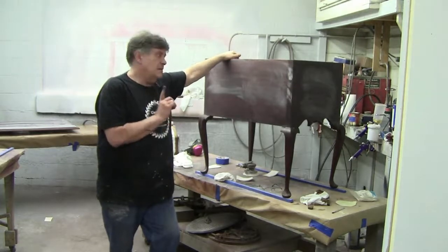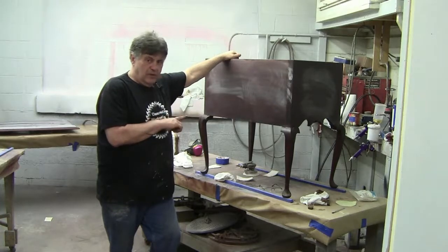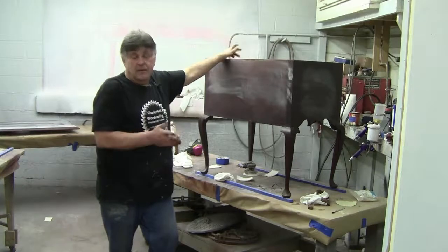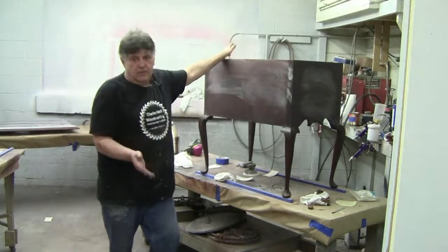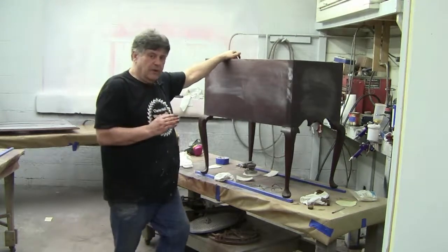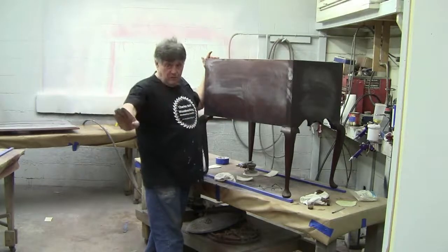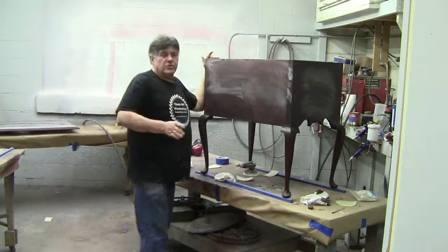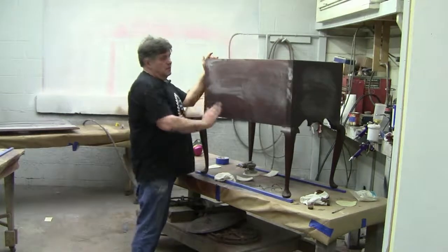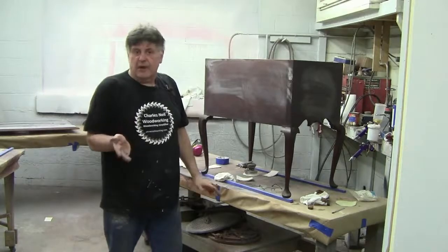If you've got an alcohol or a water-based dye on here, and you come back over top of that, well, you're going to start pulling your color off, so you can't do that. But again, you can take that grain filler, thin it a little bit, take that same cloth, once you've pretty much done all your sanding, put a light coat on, thin it about 10-15%, again, where it's about like mayonnaise,